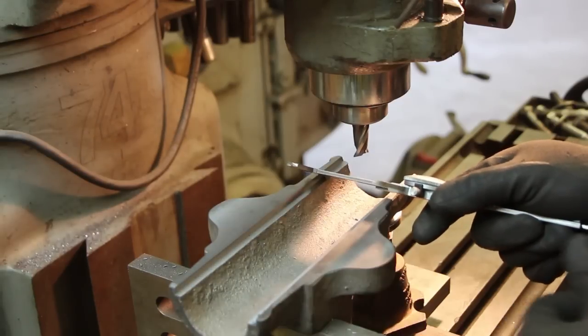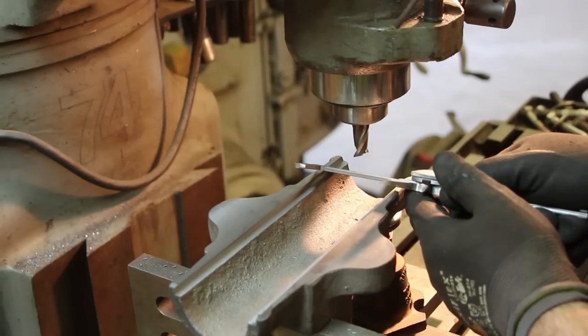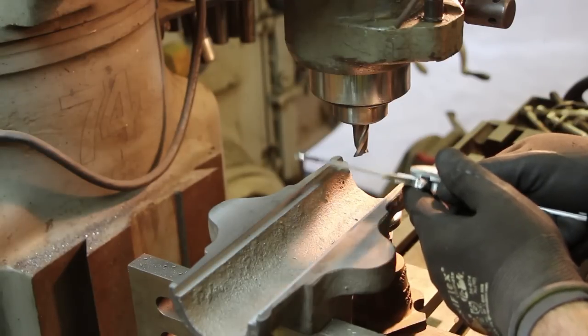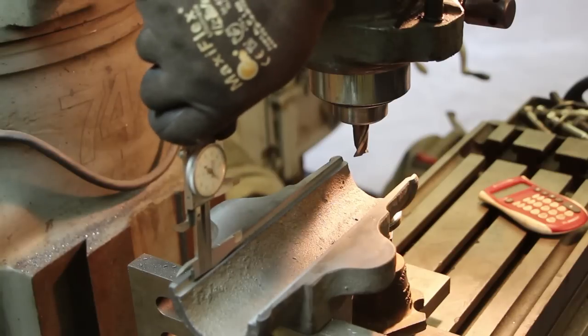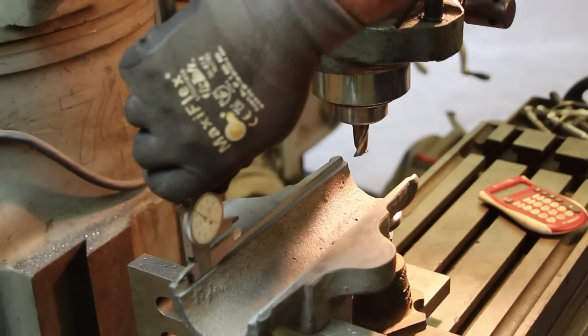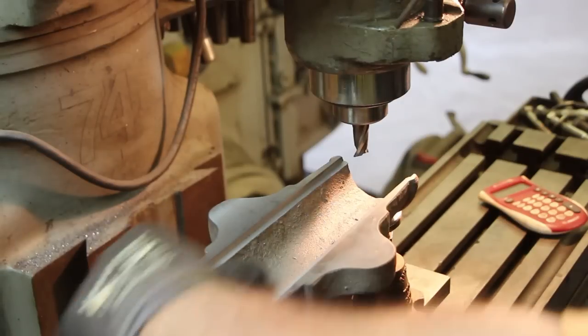Right on the money. We were looking for 2.730, and I am just right on that. And let's see, the depth was supposed to be 200 thousandths, and it's about 10 over, but no big deal. All right, so